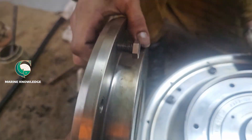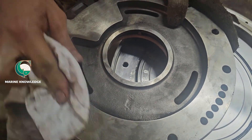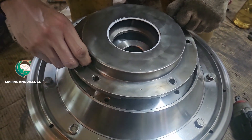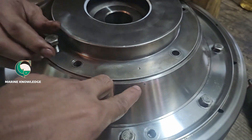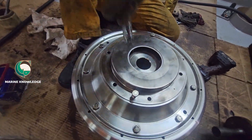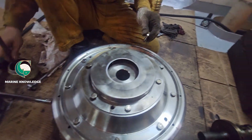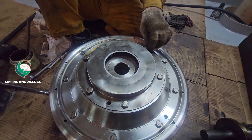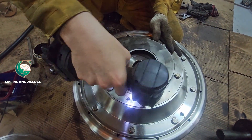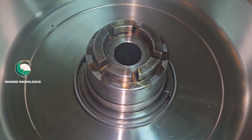Next comes the cover for the operating water ring. Make sure all the holes are clear of any dirt. You can see the O-ring on top along with the labyrinth ring. Match everything — we put a dot and you have to match that dot so assembly is easy and you don't get confused. The water ring, operating cover, and holder all go in line. For this bowl assembly, the main things to keep in mind are: change all the O-rings, change the Teflon ring, and check the valve plug is clear.